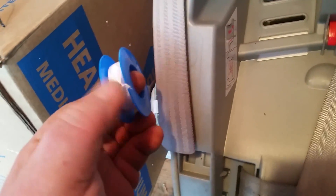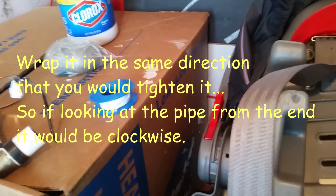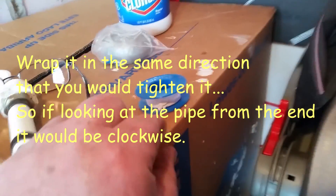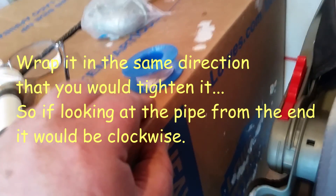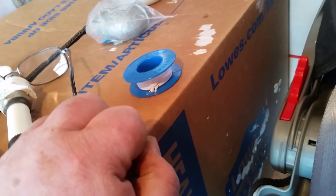You'll notice I'm using Teflon tape on all the fittings. Very important — if you don't use that, they're going to leak. Almost guaranteed. So don't forget your Teflon tape. I probably have 85 rolls of this stuff because I'm always paranoid I won't have any, but it's like 99 cents. Now you want these pipe fittings to be very tight — compared with working on a car, you want them tighter than you'd normally tighten a bolt. At least I've never broken a pipe fitting.